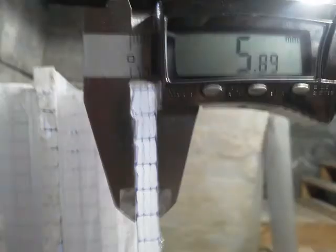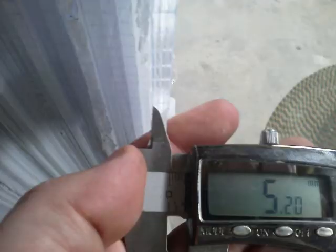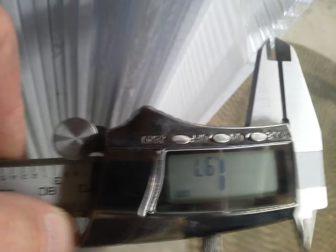You don't have to get that off-the-shelf six millimeter size. You can contact a company called Tonin Polycarbonate online and they will custom make it for you. The disadvantage is bulk purchase — you're going to get like a hundred sheets at a time — but the advantage is that you can customize the order. I customized it into a four-wall sheet, so three air gaps, in the same size and thickness. It's still called six millimeter thick and measures very close to that. The inside airspace measures about five millimeters, and the second of the three flutes measures close to two millimeters on either side.